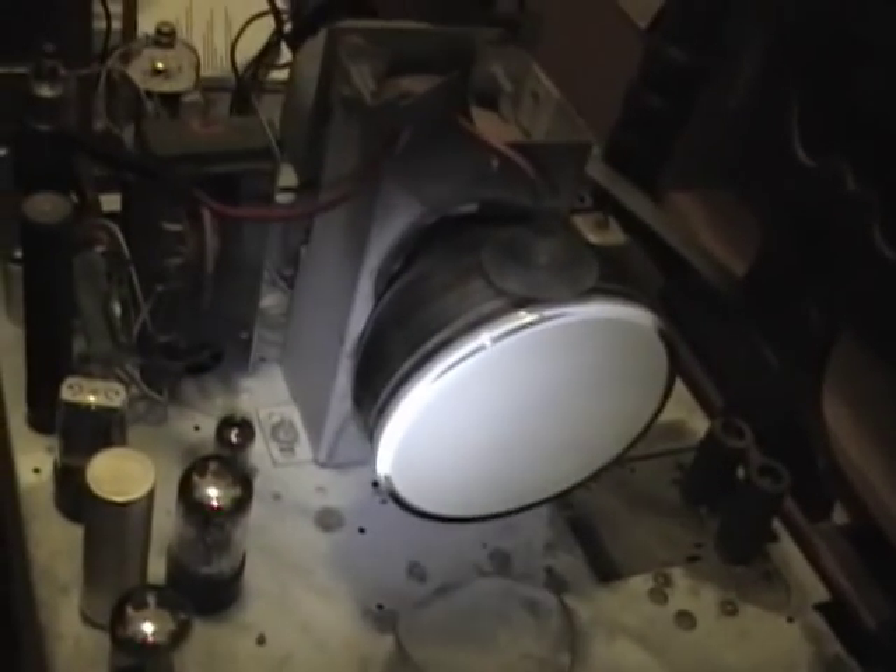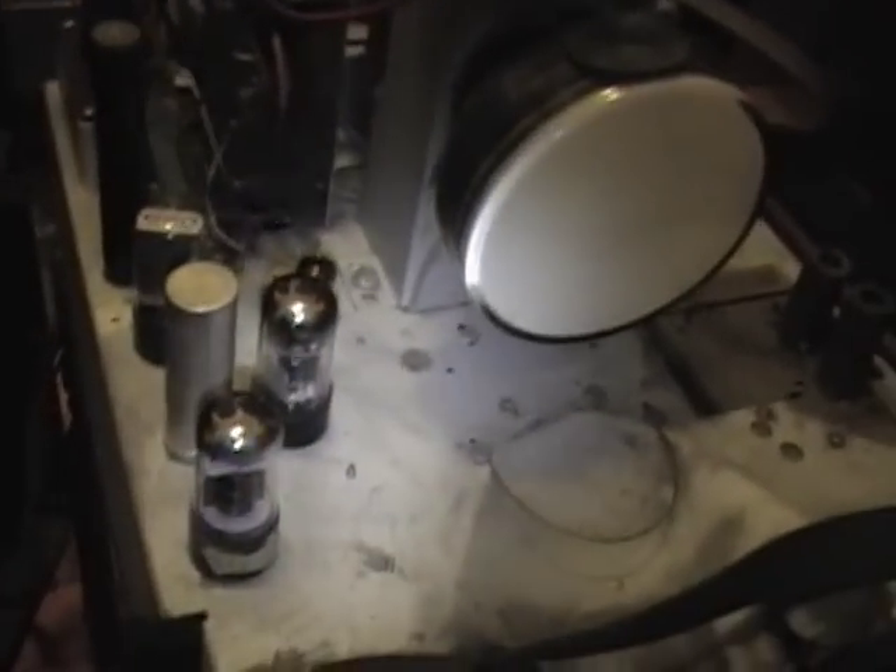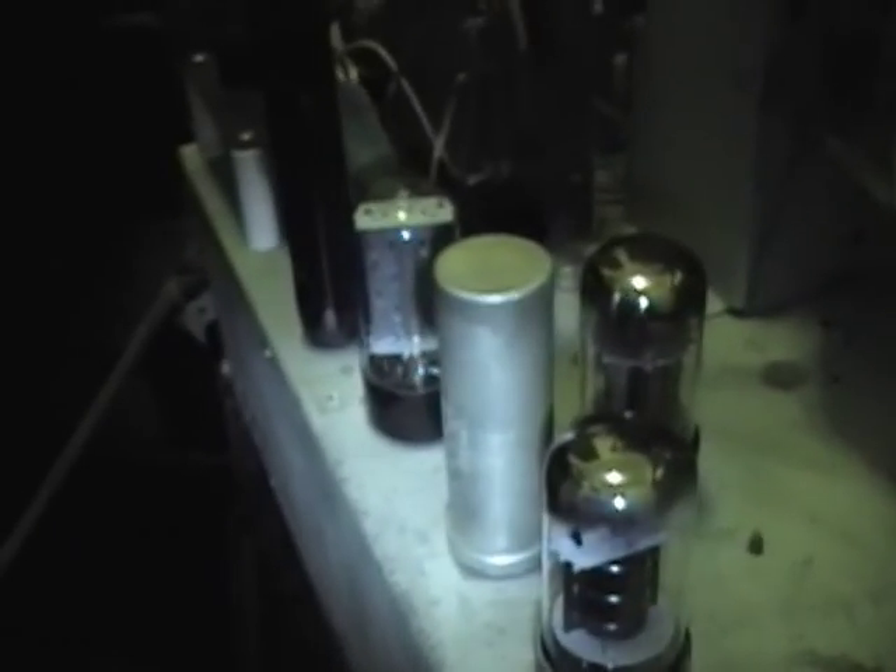I'll flip the chassis down, put in my little five-inch test picture tube, and fire this up to see if it works any better now. One downside of the split chassis is it does make it a little tough to work on unless I pull out both chassis onto the workbench. I have the one cable with all the power lines going to it, but I cannot reach the audio cable, so don't expect to hear any sound when I turn this on.